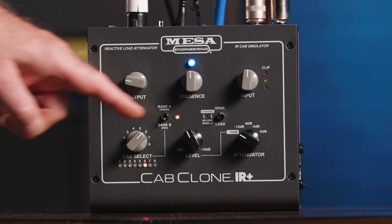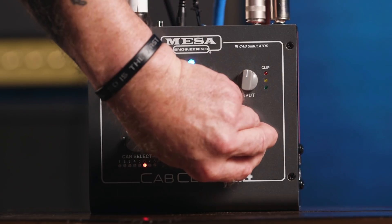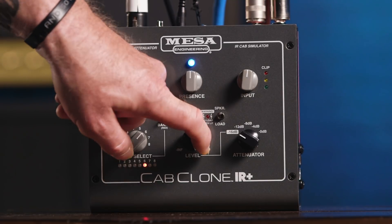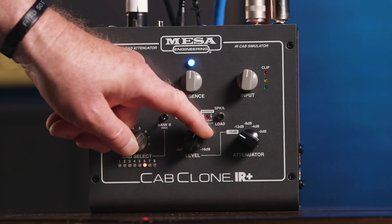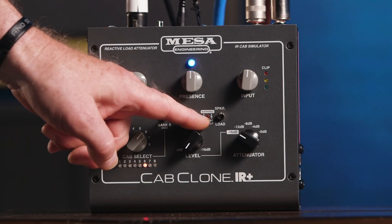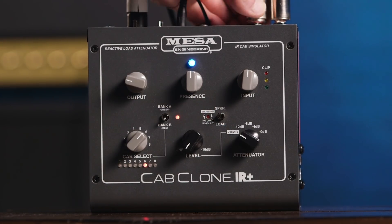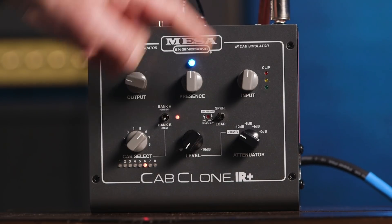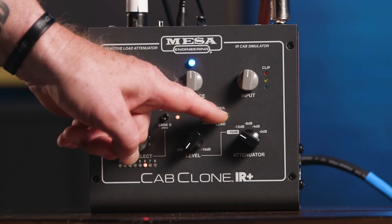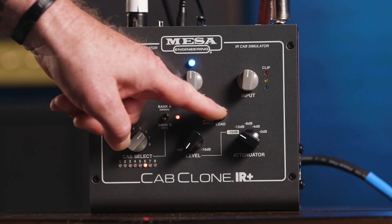The other two controls we need to look at: the attenuator — 0 dB, which is no attenuation, then minus 4, minus 8, minus 12, and 16. And there's also this control here. When it's all the way clockwise it's minus 16 dB, but as we turn it counterclockwise we go all the way to minus infinity, which is nothing, nada, zero. And last but not least, there's this switch here. When you've got a speaker attached, it has to be up. But when I detach the speaker — this is just the input from the amp — then I switch it to load. There almost always must be a load there, so if you're not using a speaker, make sure this switch is down. There's an LED that tells you if there's nothing plugged in and there's danger if you want to switch to load.